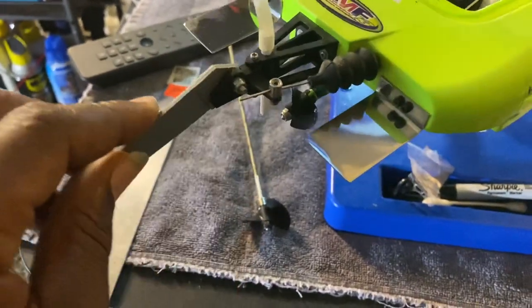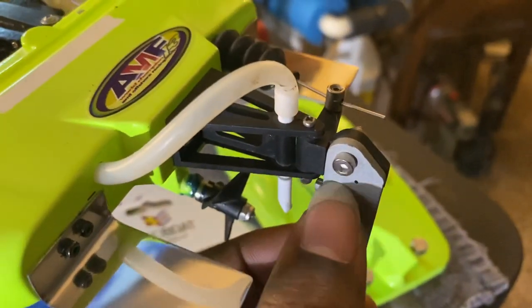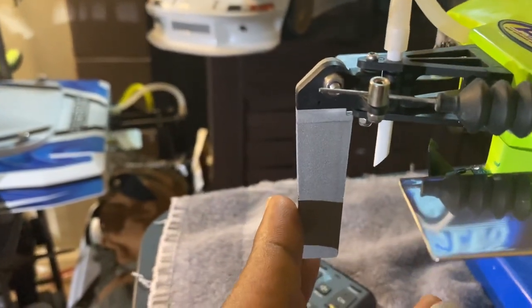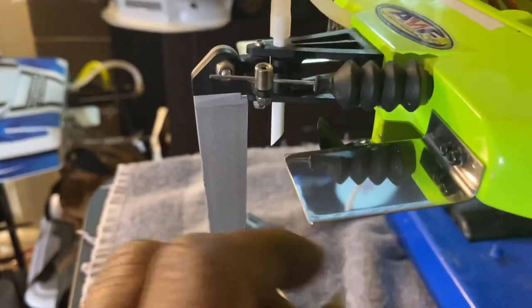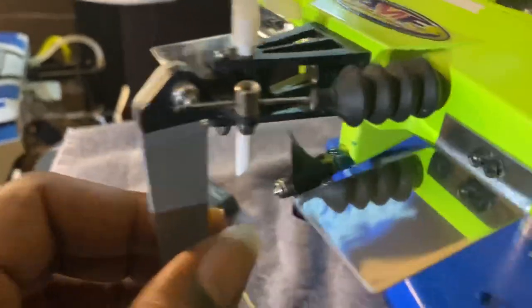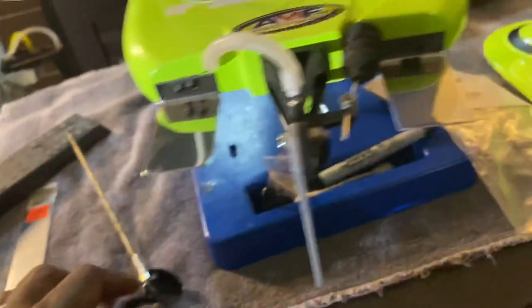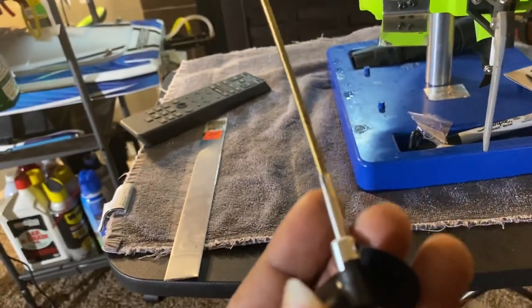Another gripe is when you hit something in the water, this flings out — which is kind of cool, but this thing ain't going that fast. There's a small pin right there. I'm going to put a pin in that and seal that all the way through. I don't know if I want to go with a small breakaway like my bigger boats. I ended up sharpening the tip of the cooling holes. This is a two-blade prop — I don't know if this came with a two-blade, I think it was a three-blade. I want to switch it to one of these cables instead of a solid — this is out of the Arrow, it's eight and three-quarters long.